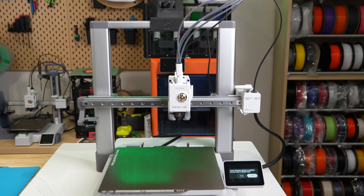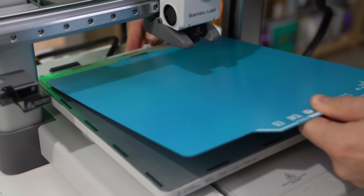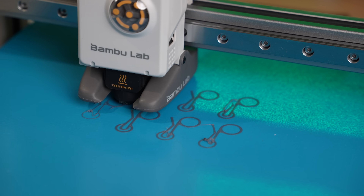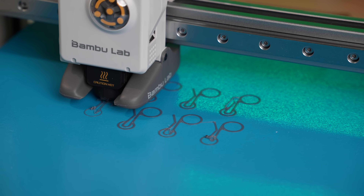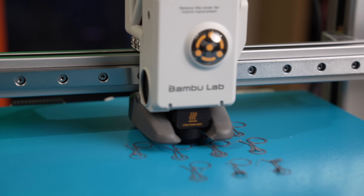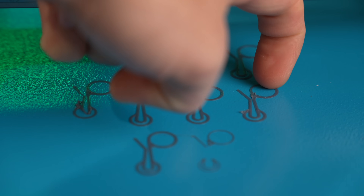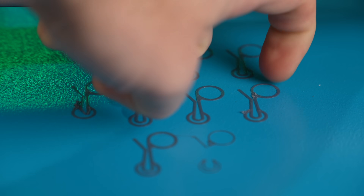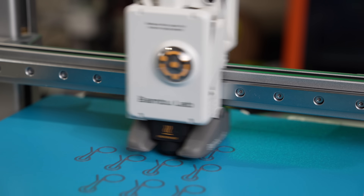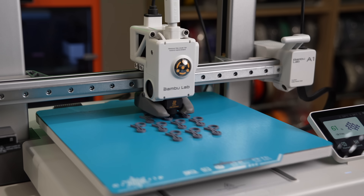For testing, I started out using the A1 and began with the Frostbite plate. I swapped out the standard powder-coated PEI plate, loaded in some PLA, and sent off a small tray of chip clips with the bed temp set to zero. I noticed right away that there were some sections of blobs where the filament wasn't sticking at all, so I killed the print. What I found odd was that for the pieces that stayed down, they were sticking really well. So I removed the plate, gave it a scrub with soap and water, and tried again. This seemed to do the trick, and the next plate of parts turned out perfect with excellent adhesion.